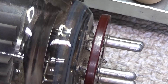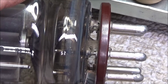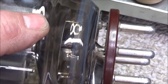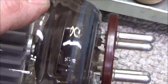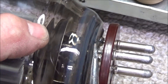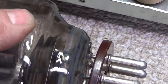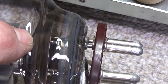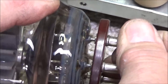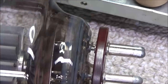And to show you just how easy it is to find the problem - you can see the pin going into these terminals. I'm able to move the terminal away from the tube on this one. This one is tight, still soldered in very good. That one's still tight. But this one is completely loose. Yep, exactly what the problem is. These pins have become desoldered from the terminals, and you can't get any filament voltage this way.